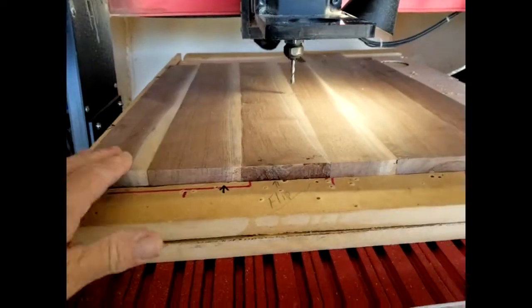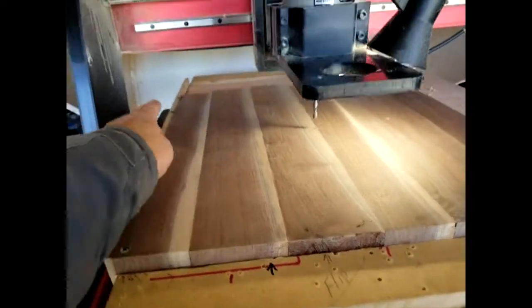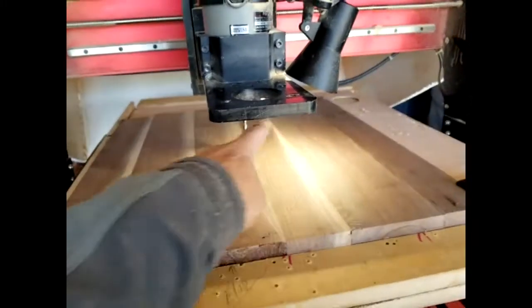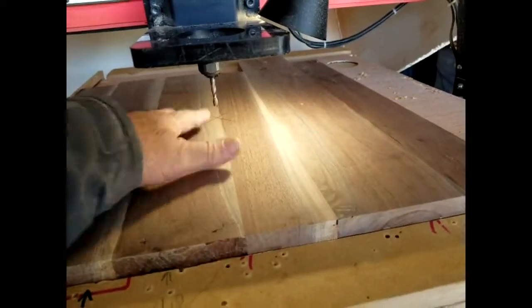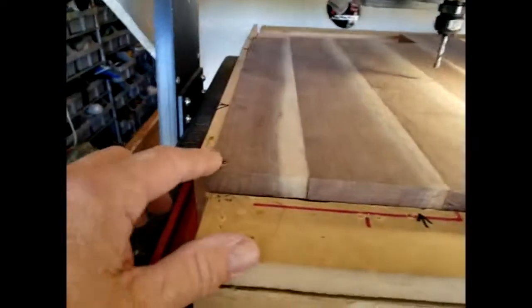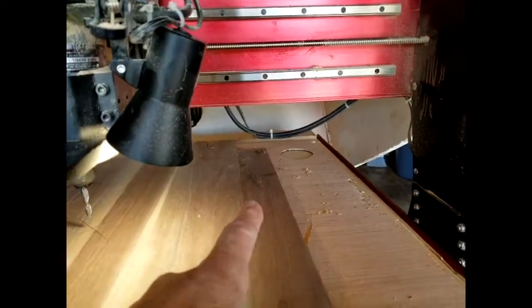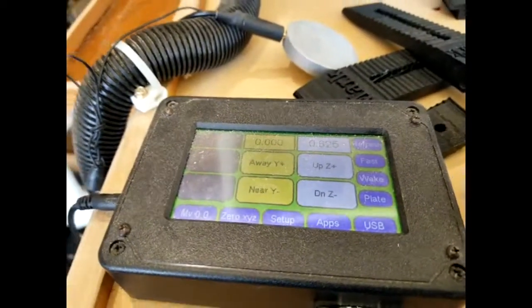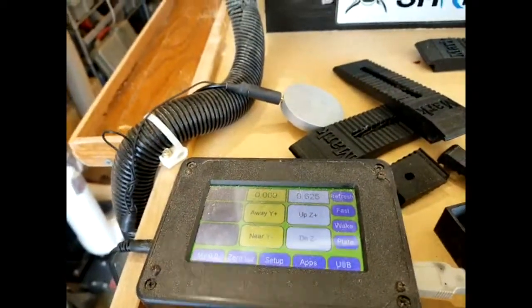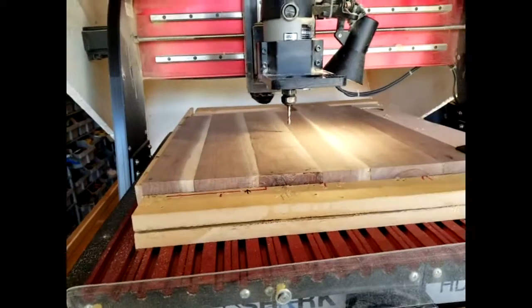After sanding, I picked up my best face and put it face-up on top. I ran a square across the back side, then went corner to corner to find the center point. I've zeroed my blade to that center, put a screw in each corner with one of the new cam clamps, and I'm ready to load up the program into the USB device. I've zeroed the bit so it knows how high the top of the work surface is, and we're ready to roll.